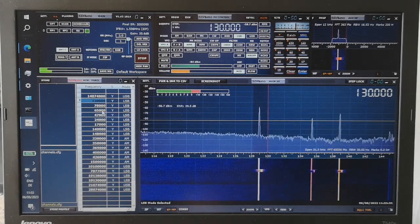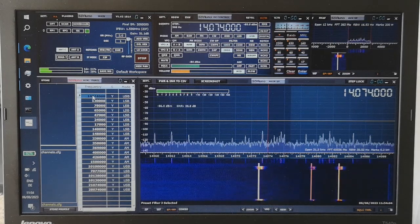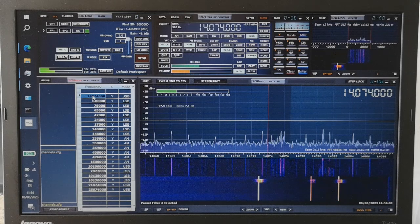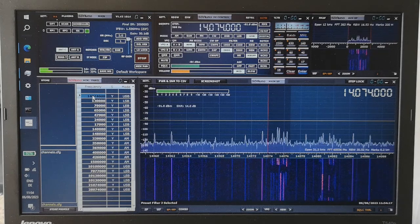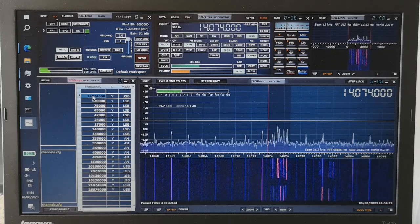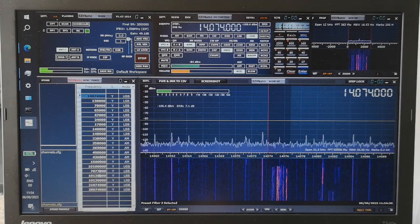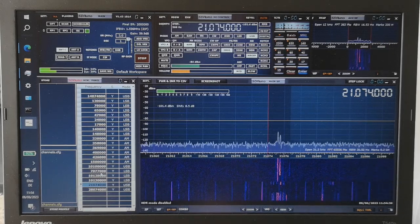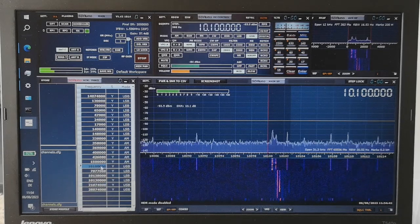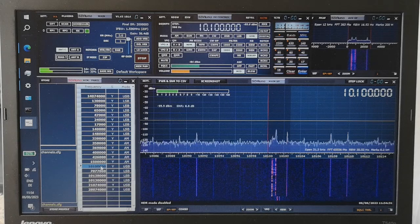If we look at some amateur bands — 14 MHz — the conditions are really flat at the moment. It was much stronger in the early morning; now it's around midday. There's the FT8 frequency, with a nice low noise floor of almost minus 130 dB. The nasty buzz from the neighbours doesn't seem to affect 20 metres. At 21 MHz there's FT8 working nicely. My favourite is 10 MHz, where there's a weather RTTY forecast at 10.1 MHz — always there. If you listen on upper sideband it's sending RYRY at the moment.